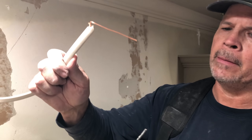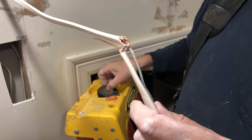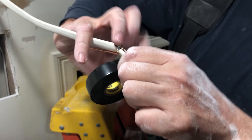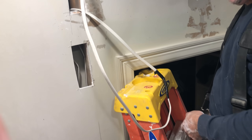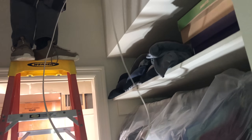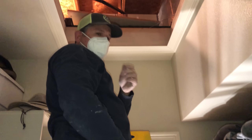Now we do the same to the other wall above the other three-way switch and replace this with a piece of 14-3. We have all our drywall cut and all our staples removed — there were only about five staples. We're using the old cable to pull the new cable. I just left one conductor on each. I was taught to start wrapping with the lead wire, the one that goes first, and work your way downstream. That's ready to pull in the attic — and that's where I'm headed. Got it. Nice — that was easy. Now we'll just hook it up and patch the drywall.